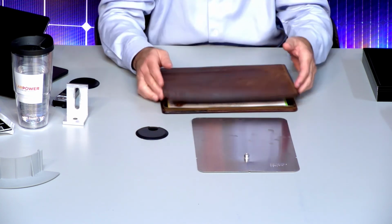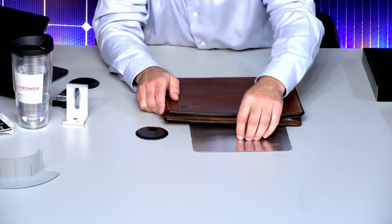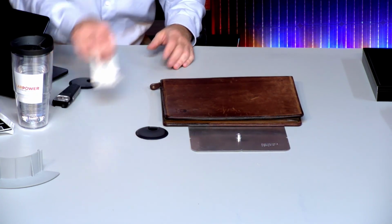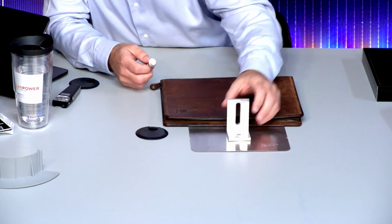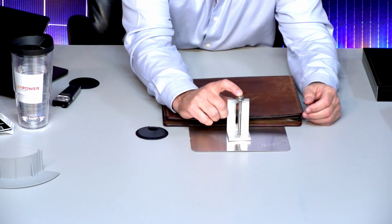So this being a shingle, even though it's not really a shingle, we would slide this up underneath the shingle above it, and then there's some sealant that goes underneath of it, and then you put the L foot on top of that. This is one of the brands that we use, and then from there, you're going to put this 4-inch lag that goes right into your rafters.